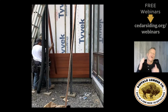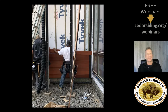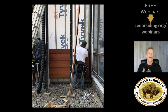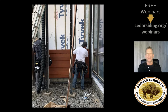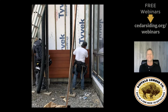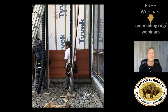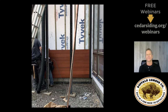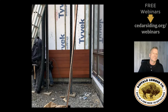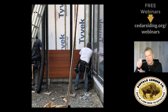All right, so originally I took this video because I was going to show you how they're going to use a combination of gun plus hand nail, because usually on a job site 99% of the time it's not going to be feasible for them to hand nail everything or use the nail caps. That's for like artists. Okay, this is a super high-end job site where I asked him how he's going to do it, and he says, well, we're going to set the pressure of the gun a little less, and then we're going to tap it in with a nail tap.